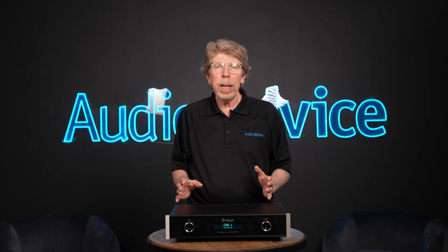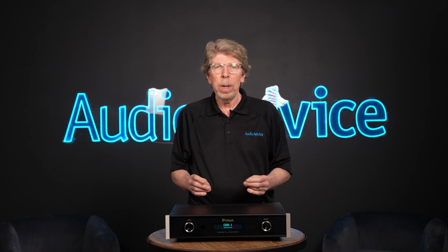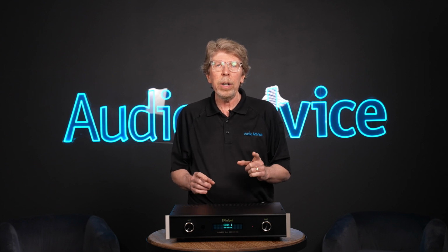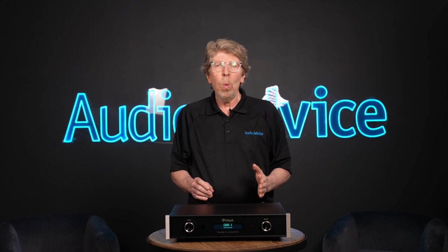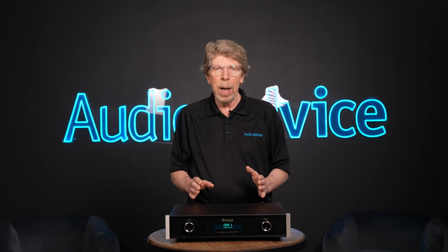I discovered in my testing the input codes on my C22 were the same as the factory default input codes for the MDA200, and it made a mess of things, but cleverly McIntosh allows you to assign another set of codes to work with the MDA200 in an easy-to-use setup menu. If you want to use the MDA200 as a DAC with your existing audio system, it will come preset with fixed output out of the box.